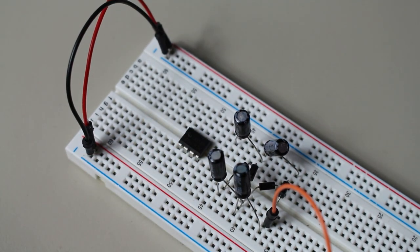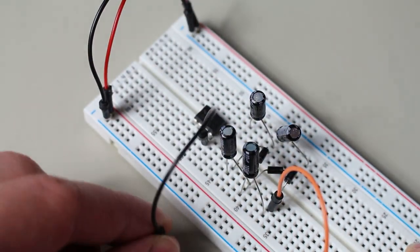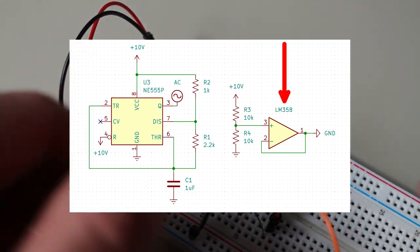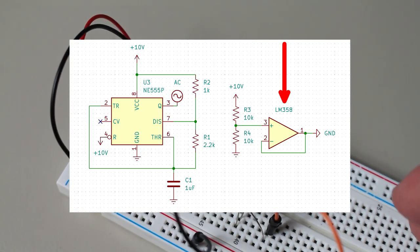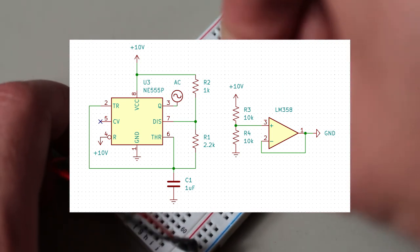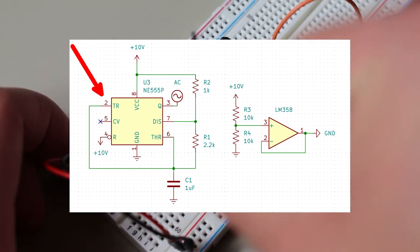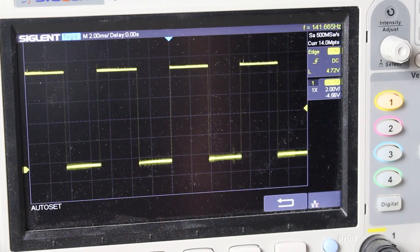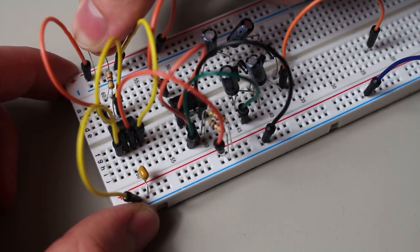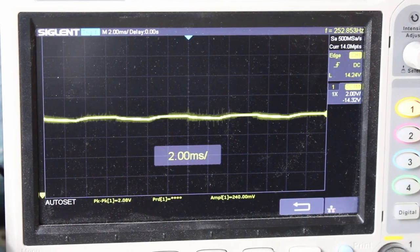The first thought that I had was to create an AC signal from the DC that we have. We will need a split supply for this. So, I just quickly rigged a voltage divider up to an op amp to provide us with a voltage reference of half the supply voltage to act as our virtual ground. As for the actual AC waveform, I opted to go for a 555 timer. This will provide us a nicely adjustable square wave. The DC power supply for the setup will be 10 volts, just so we can match the setup from the beginning. And we do get much better results when we complete everything.